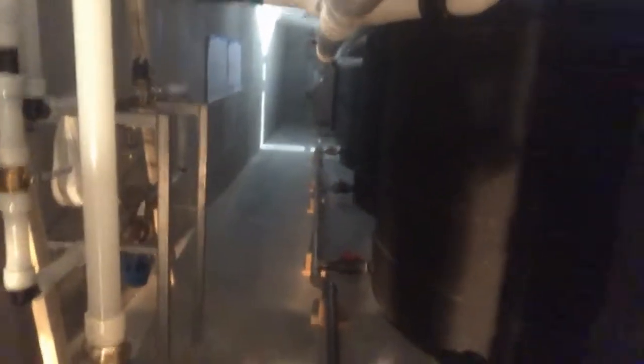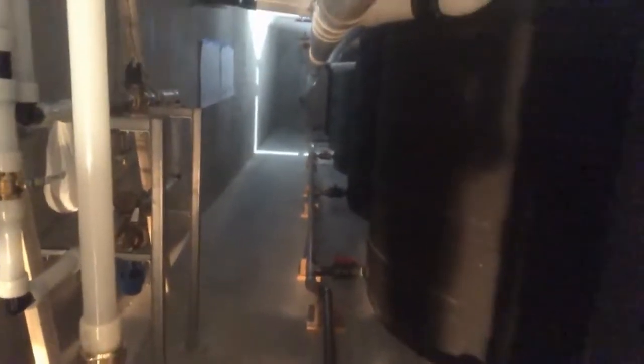For our vortex filters, we have a clean water inlet going into the tank, feeding down into the smoothing inlet at the bottom of the tank. We have equalization lines here as well — those are two inch equalization lines. We have an overflow on each tank, and then we have this suction line here with a floating filter inside the tank at the bottom going into our booster pump.